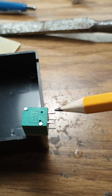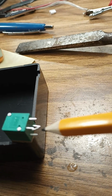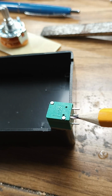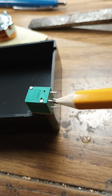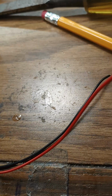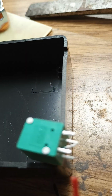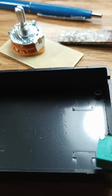This wire goes into the electronics. Don't worry about these down below. Don't mess with them. Your broken wire goes right here. And you'll probably see that there's a solder blob on it and some frayed wires, but that's where the red wire goes. Now, here's your battery clip. And there's the red wire. The red wire goes on right there.